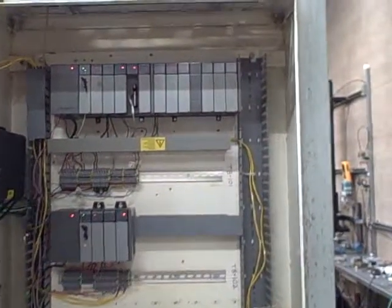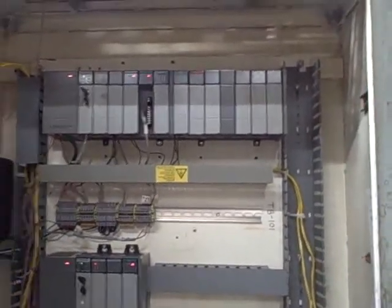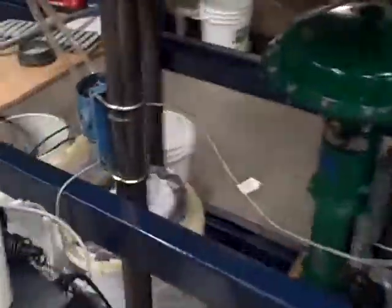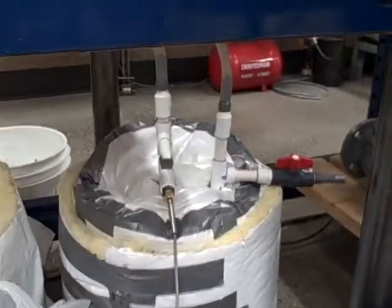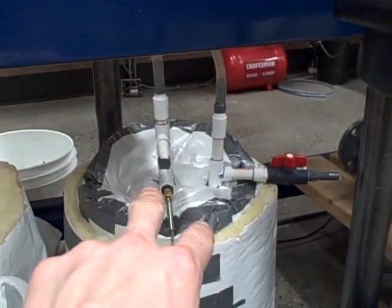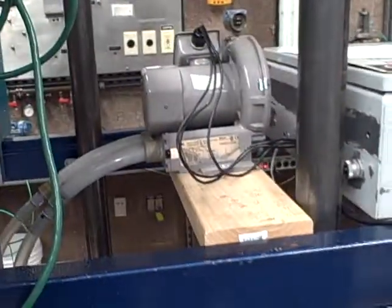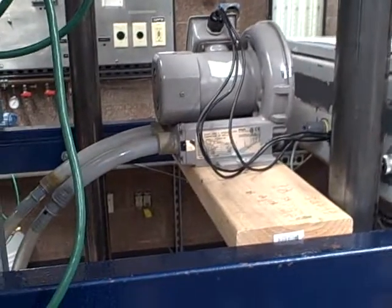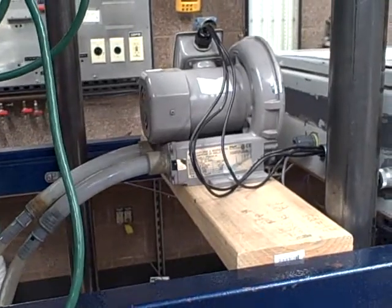A project we've been working on lately is to take an Allen Bradley SLC 500 PLC and use it to control an experimental composter. We have a small plastic vessel over here that's been insulated — right there you can see the bundled insulation around a plastic bucket. We have some organic matter in there we're going to be composting. We've got two pipes, one for air inlet, one for air outlet, and that air is circulated through a small blower here which is controlled by a variable frequency drive. The idea is to keep it continuously agitated in there so that we get good mixing and good exposure of the organic material to oxygen.